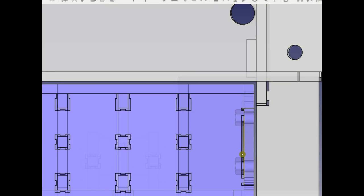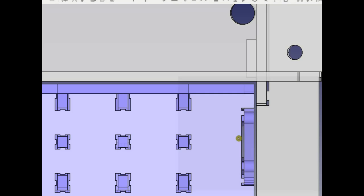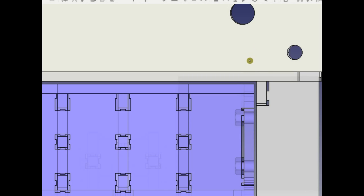So the question is, ignore it? That spacer there, we need to remove, because the rod is going to go there. That spacer actually blocks the soil from going down around the sides of the machine. But once the rod is moved down there, the rod will function as the soil block. That little spacer there is a soil block. So we can actually get rid of that little spacer. So the hole moves straight down, not around this piece that's right there. It doesn't go around it. It goes right through it because we're going to remove that soil block there. Okay, so there you go.